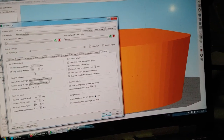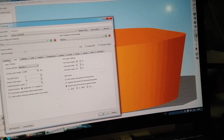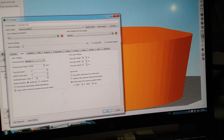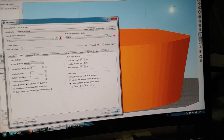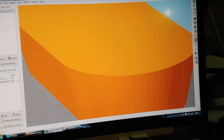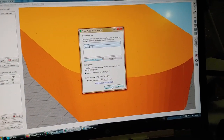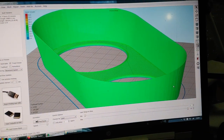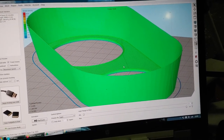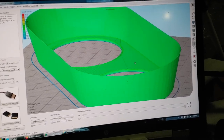So the first process stops at four millimeters, with 10 bottom layers and an over extrusion, giving a nice thick bottom. Prepare to print, select both processes - this will be four millimeters thick, nice and strong. It's going to take quite a lot of plastic - 264 grams - not so bad.